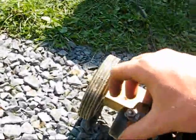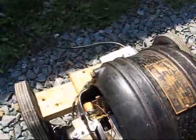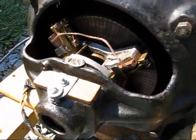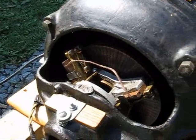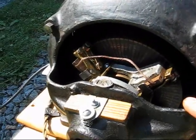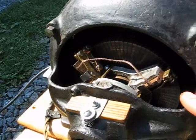I had to make the cover here in the back because this cover was missing, and I don't want anything getting into the bearings — because the bearings are like new in this thing. Now all this stuff here in the back is the brushes that make the whole motor work. Without these, the motor wouldn't do anything. This is where the repulsion part comes into the motor. It's called a repulsion induction motor because this is the repulsion starter.